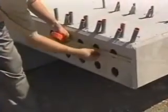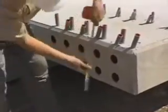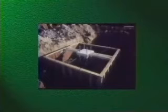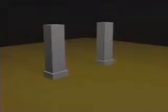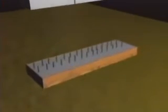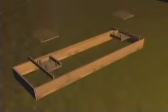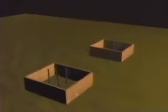It is important that a layout plan be obtained from the precaster. Some precasters provide templates, which are very helpful in creating the 3D template assembly that will hold the rebar anchor dowels in the forms. There are two situations which you will generally face in the field. One is a pattern for a column. The other is for a wall. Because of the geometry for these two applications, the template assemblies may be different.